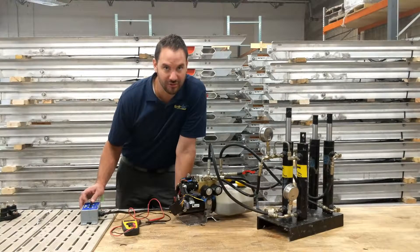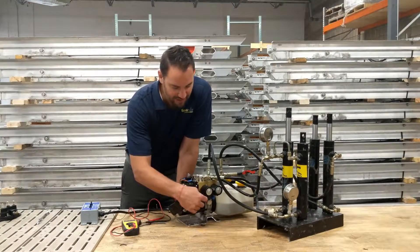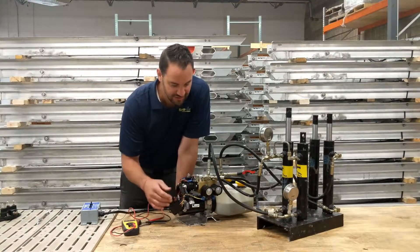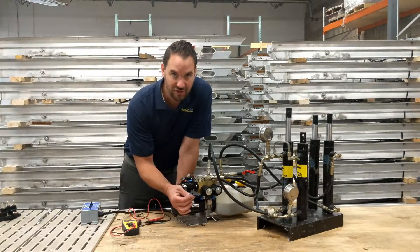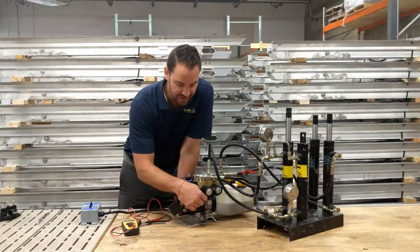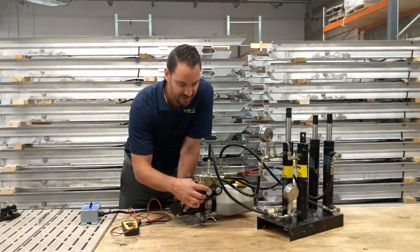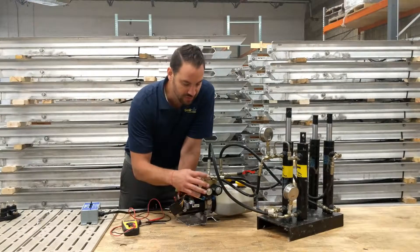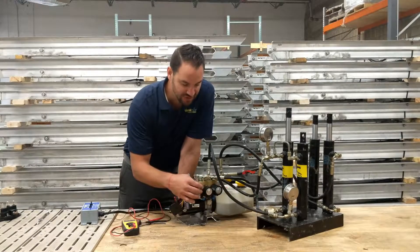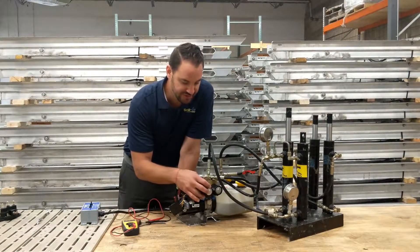The rear operates fine since there's no issues with the rear valve. If you have power and it's all hooked up correctly, first thing I would do is check and make sure you have power going to the valve when you operate one of the toggle switches. Second thing you can do is swap the coils on the valves. The coils energize and magnetically open and close the valve.